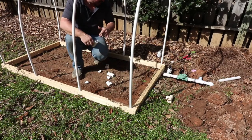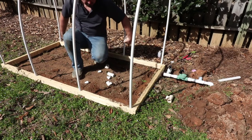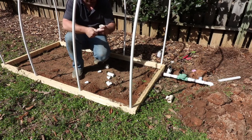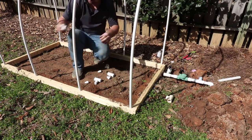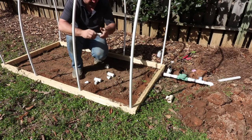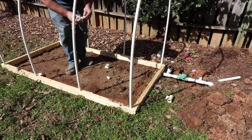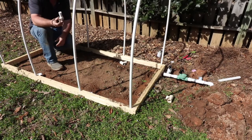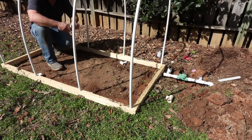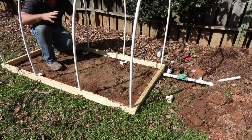I've decided to put four irrigation heads in this greenhouse, and I'm going to build a little Y out of the one-inch pipe coming around. I'm going to put one head here, one here, and two behind me in the same general location. This coupler has a threaded half-inch piece on top. I'll thread these in, with a dead end cap on each side, and just cut the pieces of PVC to connect them. There's no real pressure concern inside the greenhouse — the water has a place to go out of the irrigation head. Main pressure issues are always on your main line where water sits under pressure all the time.